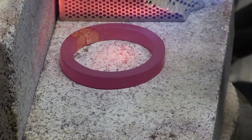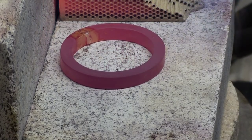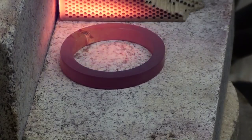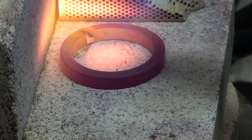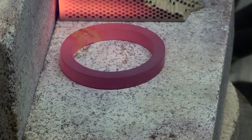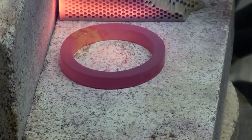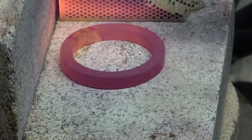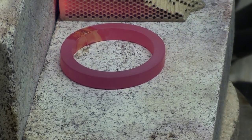It's starting to flow, and that's gone there. What I saw was a good flow of gold around the joint, which is exactly what you need to see. When you see that flash of gold, you know that in theory you should have a very good joint. It means that everything has been very clean, the gold has flowed well, and the heat has been very uniform. So I'm happy with that now and we can turn down the heat.